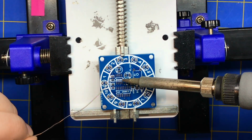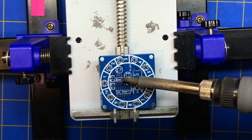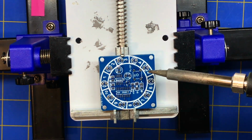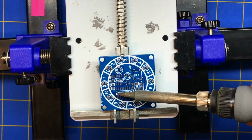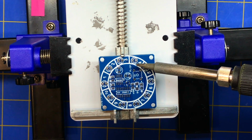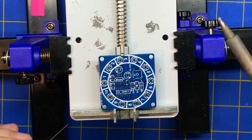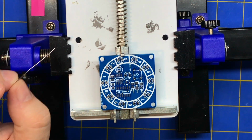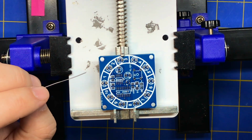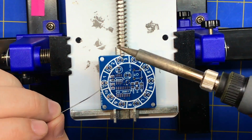So it looks like we got a NE555, and maybe this is some kind of, it's a 4017. So we're probably generating a clock pulse and then feeding this, and this is probably a counter, and it's going to count. And then maybe they're using a capacitive charge to turn off the enable so that it stops randomly. I don't know. Let's check it out. I don't have any through-hole LEDs, so I'm gonna have to use just these red ones. I wish I had some water clear ones that were better. Actually, I do have some, but I have to find out where they are. Well, let's just start with this.